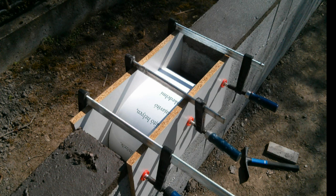This is one of the three small bridges or culverts. I asked the builders to leave out a block in the top row. I cut a strip of plastic salvaged from a commercial sign and bent it into the shape of the bridge. Large nails were then hammered into the one-day-old concrete in the layer below.